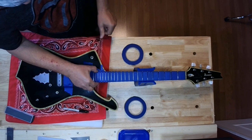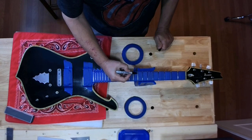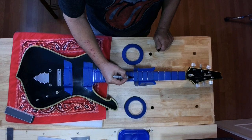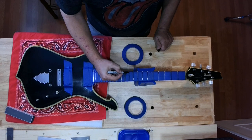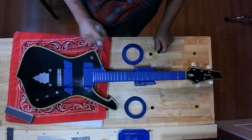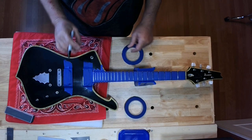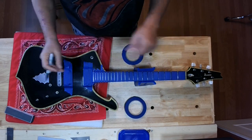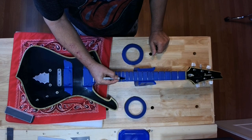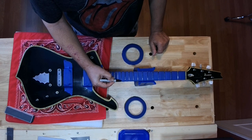You may ask: why do we take a Sharpie? I already marked all the way down to here — you mark the very top of the fret wire. This is how you know after we sand it that once those marks have disappeared, you've taken off that much material. Then we take the fret rocker and check. We know we have a bunch of rocking frets down here from the previous video, and when the marker disappears we know we've gone far enough.